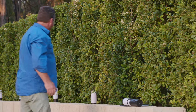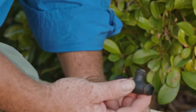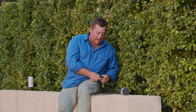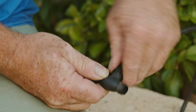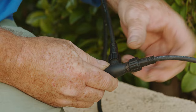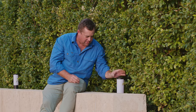Within a matter of minutes, I've already put four lights in. Now your bollards come in a little box, you've got your spike which screws into the bottom like so. I don't need to pick its location yet, but what I need to use is one of these T-joints. I pick up the power that's running through, male into female, and screw it on. Now I've got two exit points for my power. The one that goes to the side is the one that goes to the light that I'm fitting. Screw that one on, pick up my next lead, put it on. Everything's sealed and watertight. Hide that down there and move on to the next one.